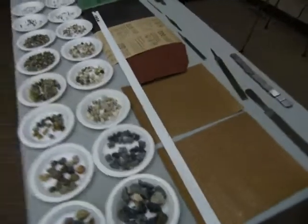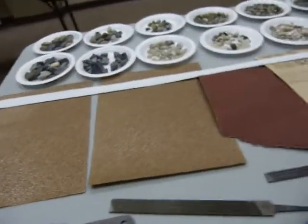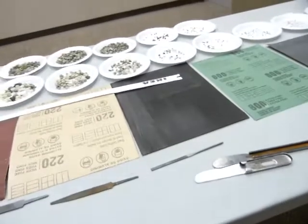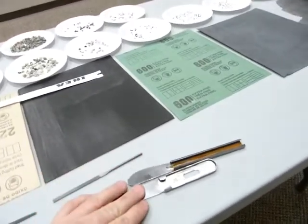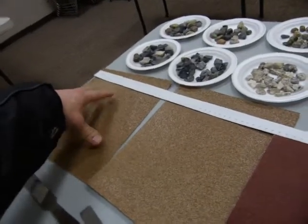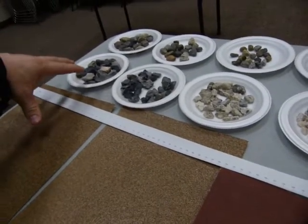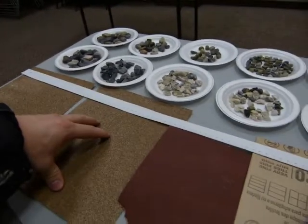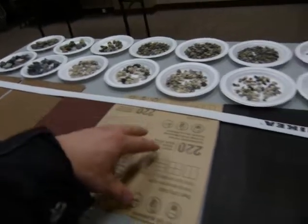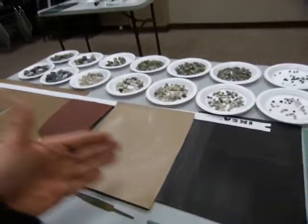Another aspect is that if you want to produce a highly polished wood or metal surface — whether you're going for a paint grade on wood or a mirror polish on a metal item — don't start with the grade of sandpaper that produces the final finished surface. You're going to have to start at the coarsest available, because the coarsest sandpaper will rip out and remove particles corresponding to the rock in it, and then you move to smaller sizes to achieve a nice even surface. Gradually work your way to finer and finer sandpapers.